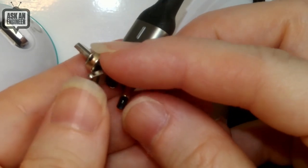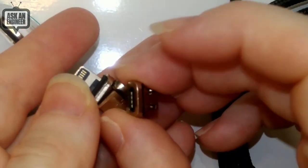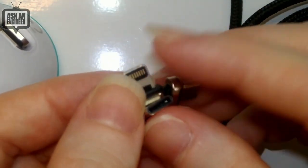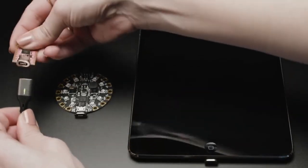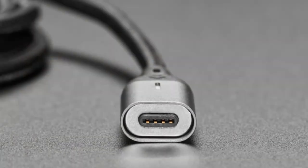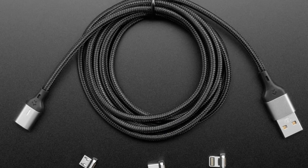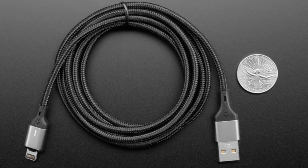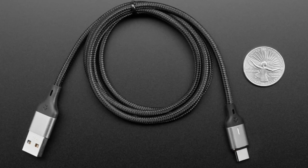At this point we don't sell the individual tips — we just sell one cable with all three tips. If people really demand individual tips we'll carry them, but I feel like you usually want one cable per three devices anyway. We also have a two meter version. If you can get away with the one meter, you'll get a better charge rate because a longer cable gives a bigger voltage drop and won't charge as efficiently.